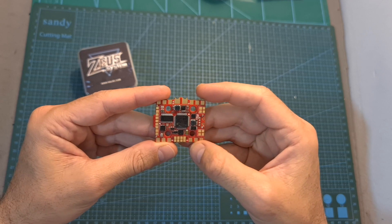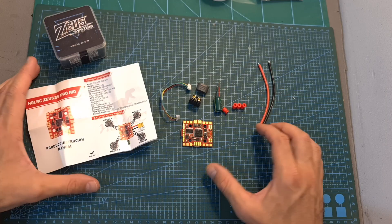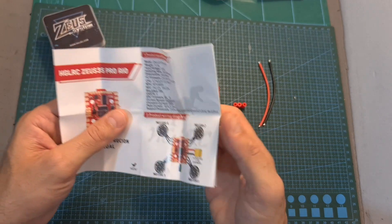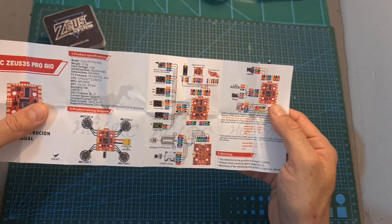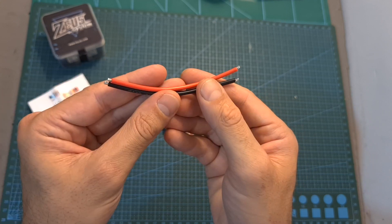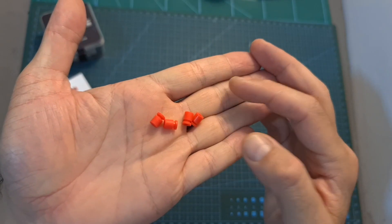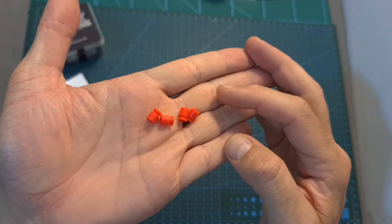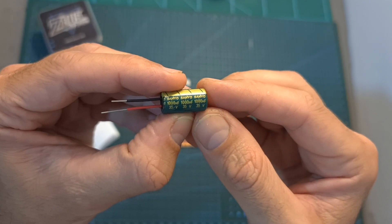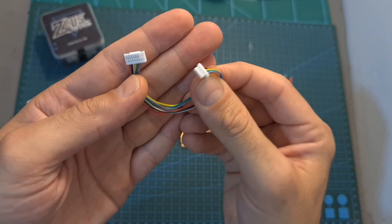Let's start with the Zeus 35 Pro, an upgraded version of the Zeus 35. In terms of packaging, inside the box along with the all-in-one flight controller you can find a quick start guide that contains the wiring diagram, a high-quality XT60 battery connector, two 10 cm long 16 gauge silicone coated battery leads, four M4 to M3 rubber grommets, some stickers, a 35 volt 1,000 microfarad capacitor, and a harness that enables you to directly connect a DJI unit to the flight controller.